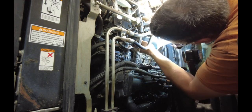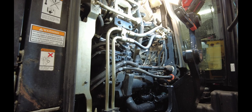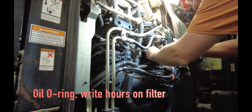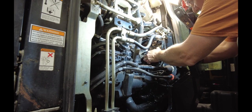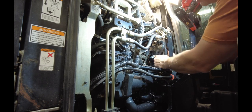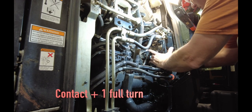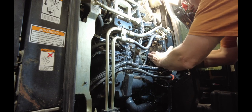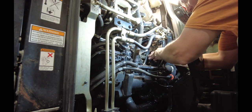Make sure that oil filter area has a great place to seat — looks pretty clean. A little oil on the seal. Wrote the hours down on it. Now according to the instructions, it says tighten it until it makes contact and then one full turn after that. We're making contact. We're not going to make a full turn, I can tell you that.